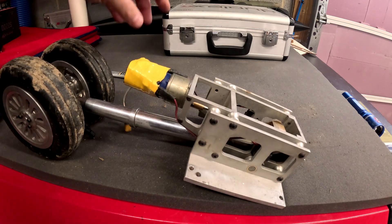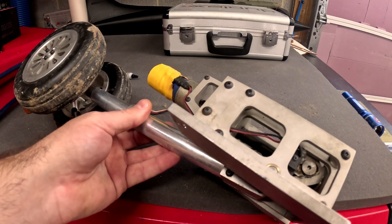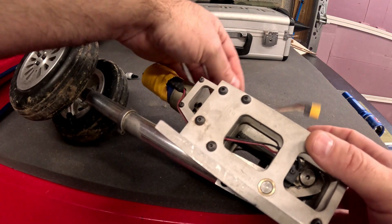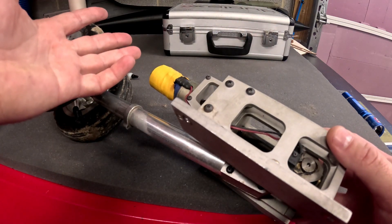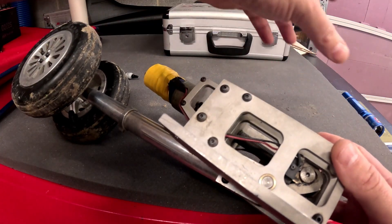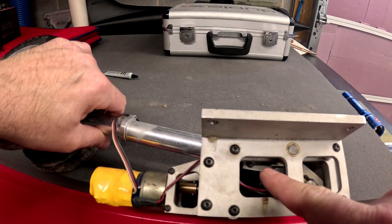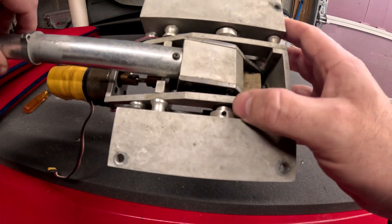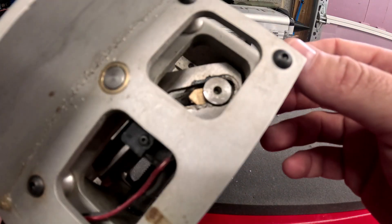These do not rely on any controllers — it's literally just a switch that reverses the current going to the motor through this three-wire connector. Once it gets to one end, the micro switch breaks the circuit and the motor stops. When you flip the switch the other way, it uses two other wires and goes through the other micro switch, which already has the circuit closed, and the motor runs until it gets to the opposite end. Then a little collar with a bolt hits the micro switch and shuts it off.